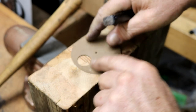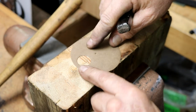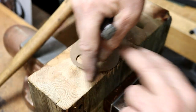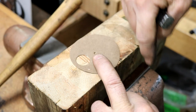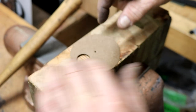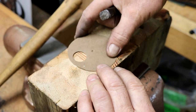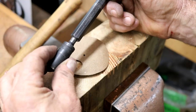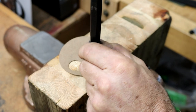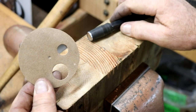A tip about punching holes: if it's close to the edge, you'll split your gasket sometimes — and that's not what you want. So leave a larger perimeter around the outside, do all your inside work first — your hole punching — and then cut the perimeter away. This is a blue point kit and there's a little o-ring here that slips on the arbor. Tap, tap, tap — works perfect. End grain of the wood.